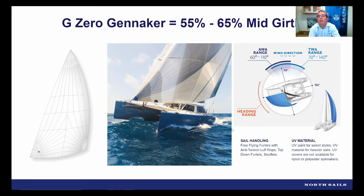You want me chiming in? Yes. I think first the question is, is there a 2-to-1 halyard? If there is a 2-to-1 halyard, you can adjust the tension on both ends, and that's great. If there's just a 1-to-1 halyard, then it'll be easier to adjust luff tension at the bottom if you can adjust it. If it's just going to a clutch, this might seem off topic, but one of the best advantages of having a 2-to-1 at the tack with the clutch is you can hook up the furler from standing on the trampoline behind the gull striker and then just pull it out without having to lean over and risk falling in the water and ruining your phone. Not that that's ever happened to me.